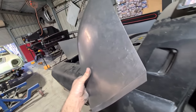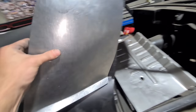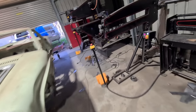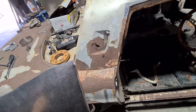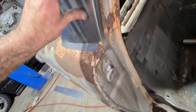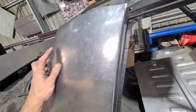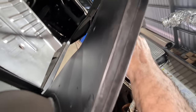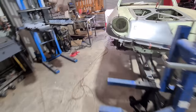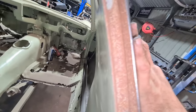Fitting pretty decently now, just got the top to come right over. I've marked this edge and just tipped it over using the soft lower wheel — trying to find a happy medium between all three cars for what it actually fits like, fitting snug for the radius of the pillar. Roof's good and tight along the back. Once you get it on this other car the radius for the pillar is different — we've opened up five mil — still tight across the back, and then this one's different again.